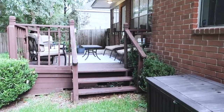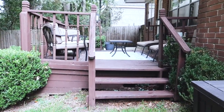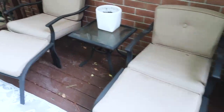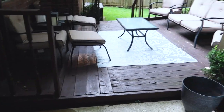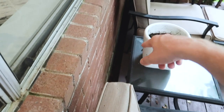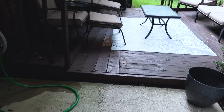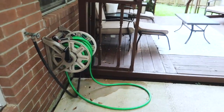Another notable finding on the outside is this deck. All the handrails are loose, there's a significant slope in the middle, and there's a lot of rotted wood. We have a deck section in the lower portion of our report. One thing I did notice is there are signs of previous termite treatment along the backside of the property, which means there's a good chance they treated for termites here. We don't see any active termites right now, but we'll document it and let the home buyer know the deck is in poor condition and is a conducive condition for termites — though the property has been treated, which is a good sign.